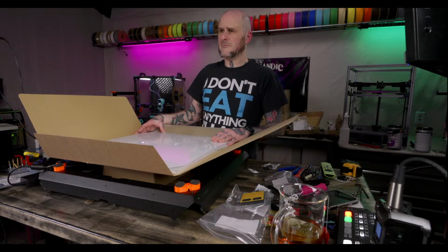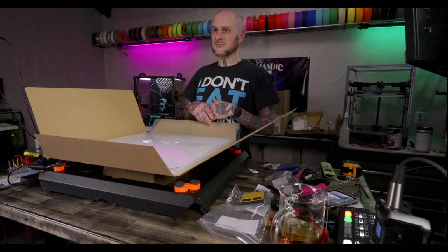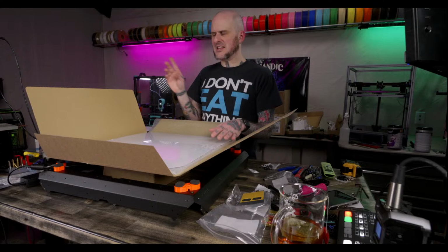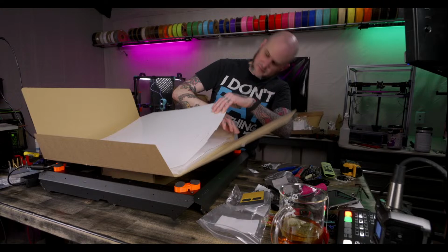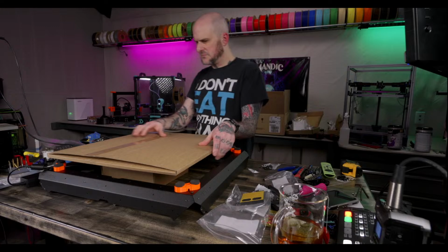What speeds do you run your 2.4 at? It varies wildly. It's all over the place. Right now it's printing pretty slow because there's a lot of really steep overhangs on this design. The way they designed this part is a little funky, so it's got a lot of overhang on it. Nope, the bottom panel's not in here. Okay. So it's printing pretty slow. It's also printing 0.28 millimeter layer heights.